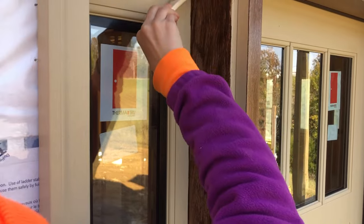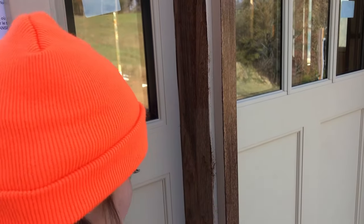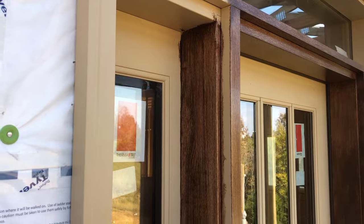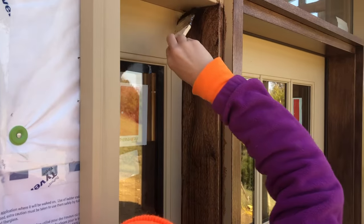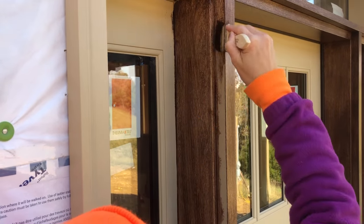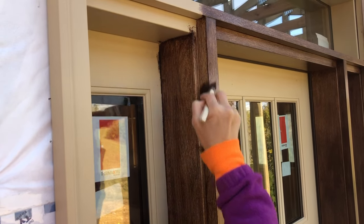You obviously don't want any really dark patches, so you just kind of pull it down like this and keep going. I start doing the section next to it and take some of the stain from that side and add it over here. If you want it to be really light, you can wipe it away — just take a rag and wipe like this. I want a darker look so I'm going to mix the stain back over that part of the door. This stain does dry pretty quick, so you want to do it in sections a little bit at a time so you don't end up with it completely black.